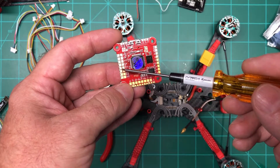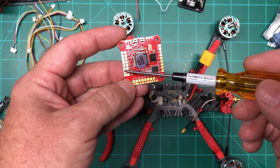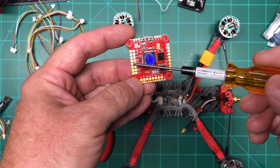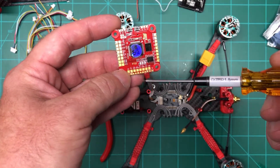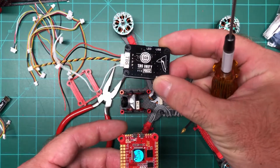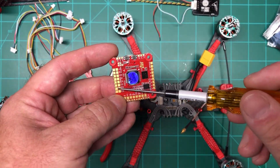As you can see there are many solder pads. You can actually do dual cameras — like a cheater quad with a camera in the back and front — but I'm not too worried about that. There's a 9-volt pad, so you can power a VTX without having to solder to the battery leads. I'm going to use a Unify on this build, which takes 7 to 26 volts, so 9 volts works well.